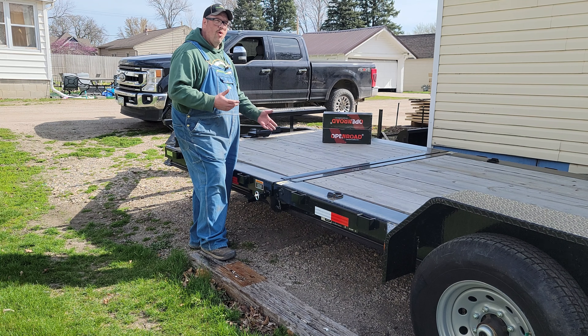This morning I drilled some holes, and in talking about drilling holes in metal — before today I had never used a step bit for drilling metal, and let me tell you, that thing's a game changer. Here's the step bit I've been using — it's a Milwaukee and this one goes up to three-quarters inch. I needed that for the receiver pin, and most of the drilling only needed a half-inch max step bit, but man do these things cut through metal.